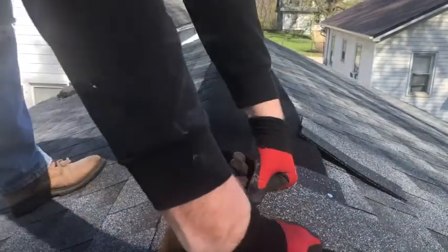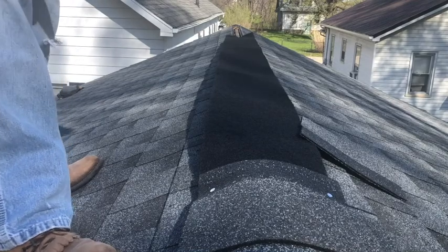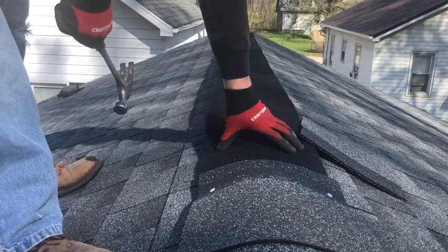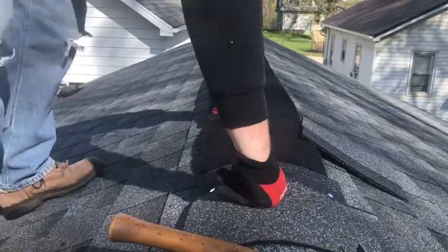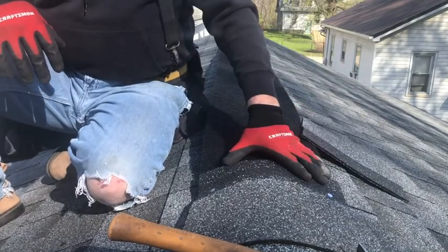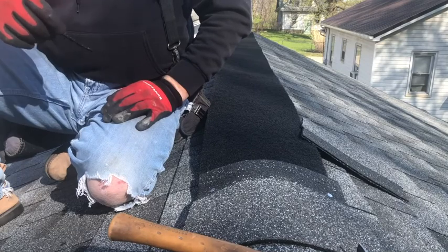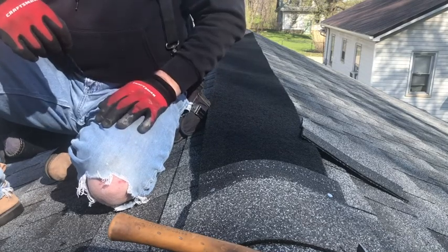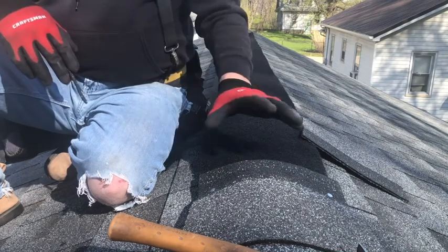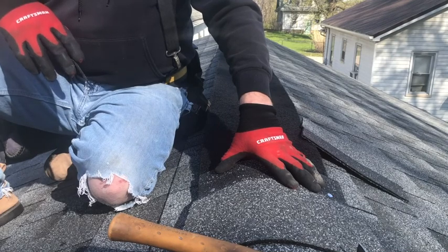When we're done with this video I'll give you the total cost — right now I'm just under a thousand dollars worth of material for the roof. This roof is 27 foot long this way, and each side is 10 foot. That's how you figure out what you need for shingles: you do 27 times 10, that gives you your square footage for each side. Once you have the square footage, you divide that by a square — a square is 10 foot by 10 foot.